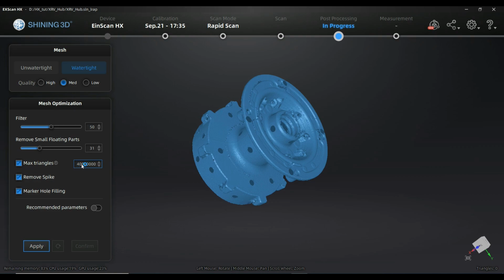If you are scanning really big objects and you want to be sure that you can calculate something like a preview showing you if you have captured all the areas that are relevant for you, that will help you out quite a lot. Imagine you're at a customer's place, scan the car, and you want to be sure that all the different views, in this case project groups, are covering the areas you want to have in the merge, and they are working in the merge without deleting any areas.